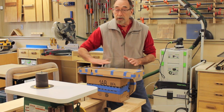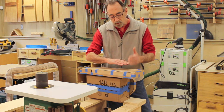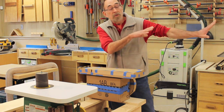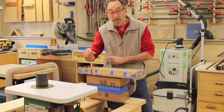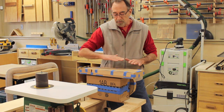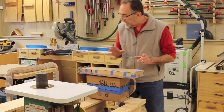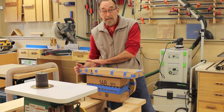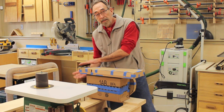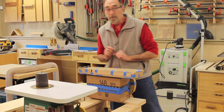The other position that you'll use a lot is on the top, on the flat part of the belt. There's a work stop here on the end that keeps the material from shooting off because the belt is spinning this way. So that's about perfect. It's almost exactly the same height as the oscillating spindle sander. Occasionally you might want to come over to the end and sand a concave piece on the end of this roller. Pretty good height for that too.